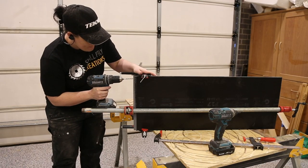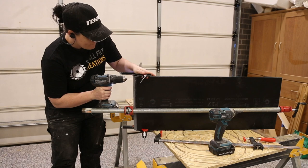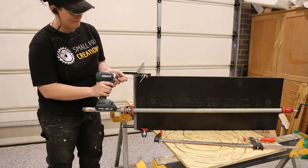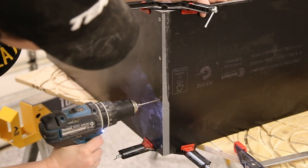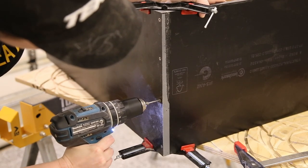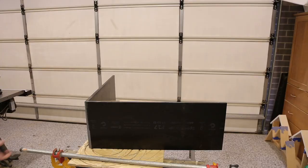With the pickets drying I could start to construct my box. I made sure that the factory sealed edges of the form board were all facing down as I wanted them on the bottom. I used square clamps to get my board square and once again pre-drilled and screwed the boards into place. I'm using 40mm decking screws so they won't rust or fail on me outside.